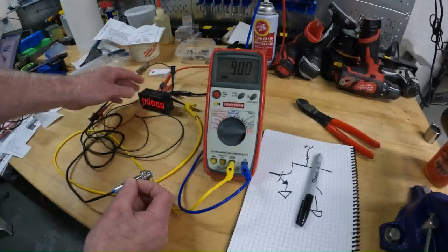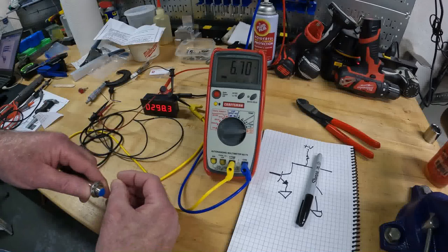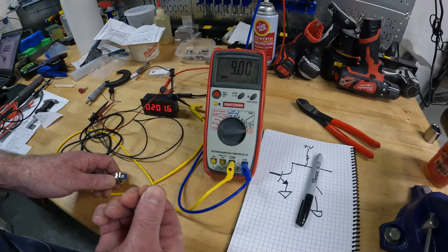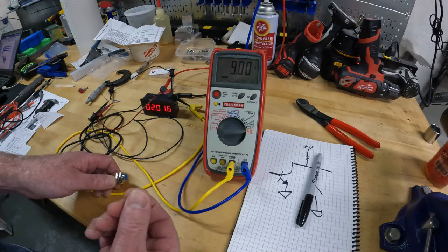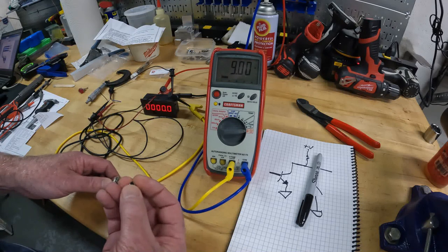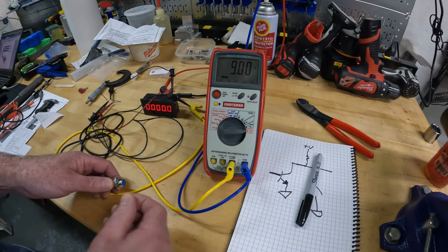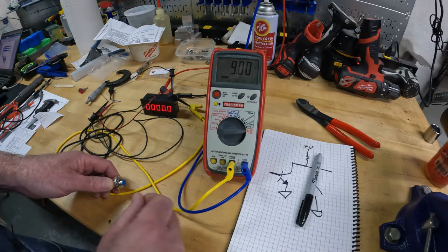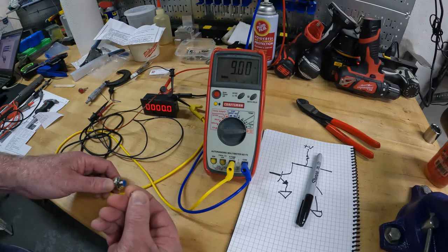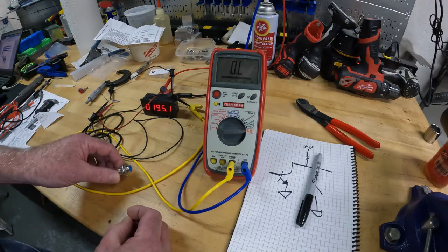You can also see on the display that moving the magnet starts counting. When you go to put these magnets in the drawbar, you really need to check each one and put a dot on it with a marker to make sure you don't put it in upside down — because it's virtually impossible to get out once it's pushed up tight and down into a slot. Make sure you have it going the right way before you put all 20 of the magnets in.